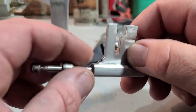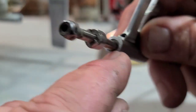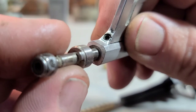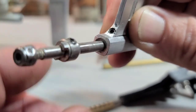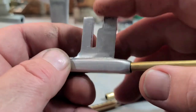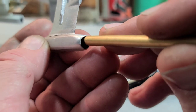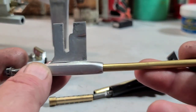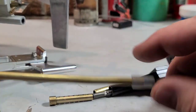The fix for worn bushings is either get a new bushing or replace the whole strut. Some struts have sleeve bushings that you have to compress and pull or tap out. You'll see a little bit of play where the shaft goes into your strut — that play will allow water into your boat, and normally it'll just be a little trickle. Another common issue with struts is your stuffing tube not being quite big enough or fitting tight enough into the strut itself, so when you're running your boat water is actually forced in through the stuffing tube.